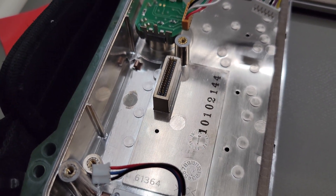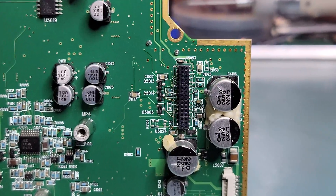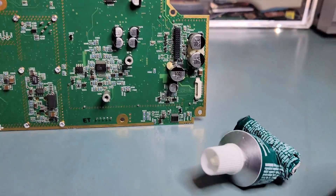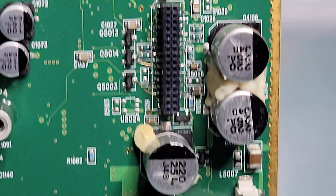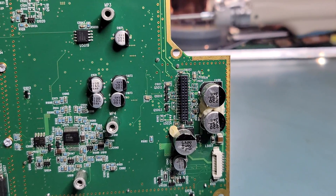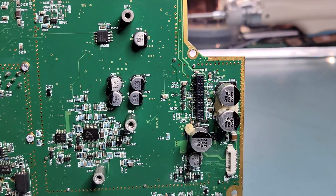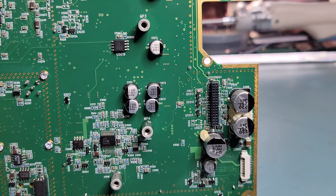We're going to go ahead and repair and reinforce the connector on the board. I just finished cleaning up this connector very carefully to remove all the flux — that's important prep for applying the neutral cure RTV. I'm going to apply RTV on the ends of this connector because it's so fragile, and hopefully that will hold it down enough to safely install it. If this board ever needs to come out again, it won't take all the pads with it. While that's curing, I'll clean the rest of the instrument since it's very dusty.